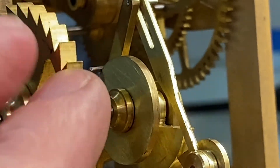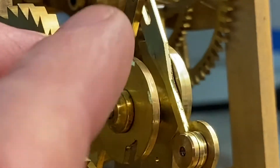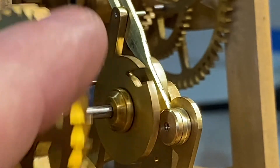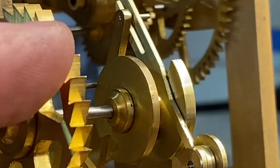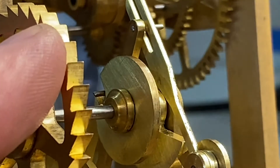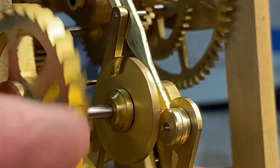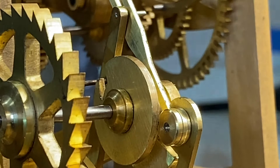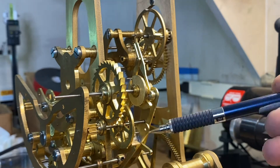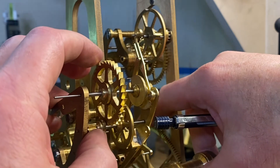The next month it stayed out — that was a 31-day month, never went in. Let me progress to February so you can see what it looks like on the shortest month. Now we're in February and you see this pin drop farther back down there. When it comes around for a 28-day February, that pin is already in the slot, well above that cam, so the pin drops into the slot and it'll be down there for some time, then trip around and be back out on the outside. Here's the trick: this lever right down here is what controls every day of the week. We saw that before — this little wheel will get trapped and released.